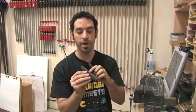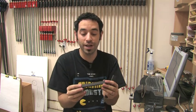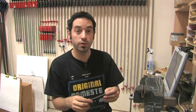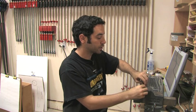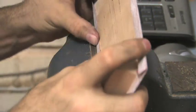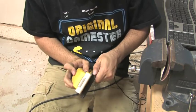Now I'm going to take the little ebony pieces and make just a very subtle round over on all four sides. This way it just gives it a nice soft look that once it's embedded in the bubinga it'll just look really natural, nice and soft and it'll blend in with the piece. Getting something that's really square like this but really tiny to look like this is actually a little bit difficult because it's so small - I can't even fit it in my bench vise. So I'm going to use a little machinist vise over here. I've got a random orbit sander pad folded in half - that's going to not only grip the piece but it's going to pad it from the metal jaws. A block plane is perfect for removing the extra material at the corners. I follow up with a little sanding to blend everything together, and the final finessing has to be done with the ebony strip out of the vise.